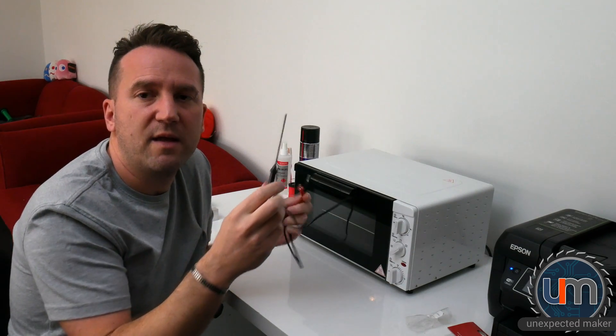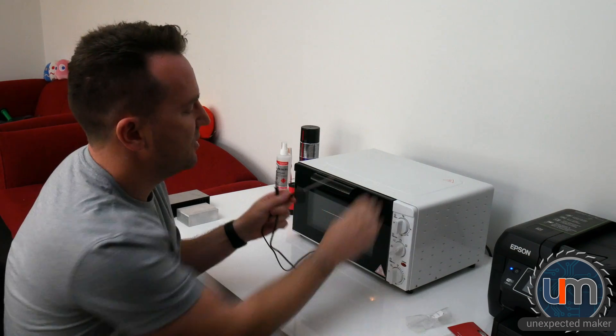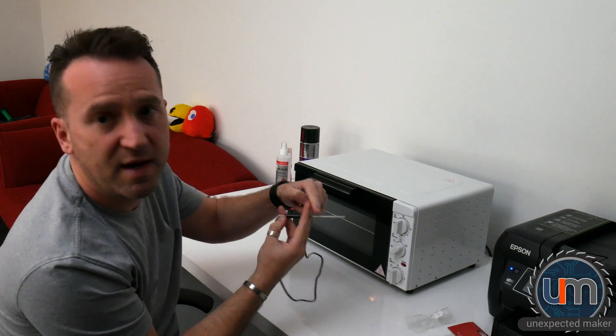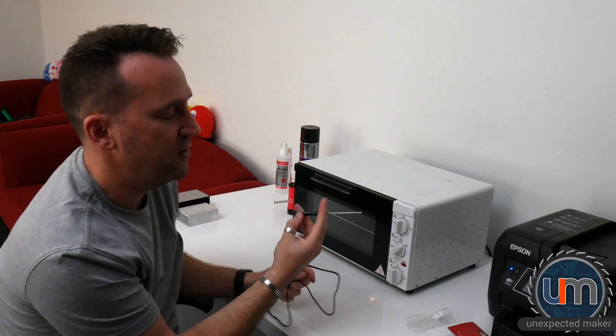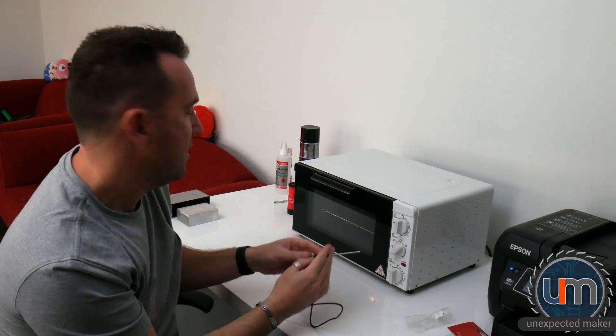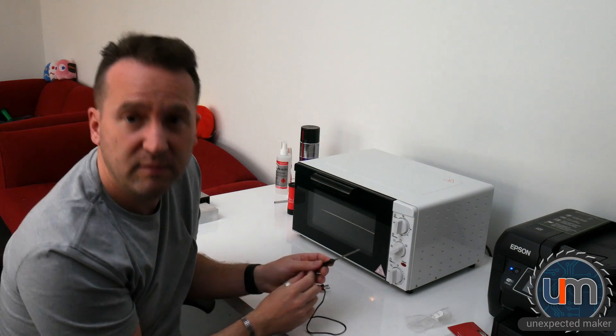That's it here. It's designed to plug into my multimeter. The idea is to drill a hole in the back of this unit, put the probe through and have it hot glued to the end, so that way it can actually go fairly far into the back of the unit and get a good all-round temperature reading, rather than the one that came with the unit, which is about a centimeter in length.